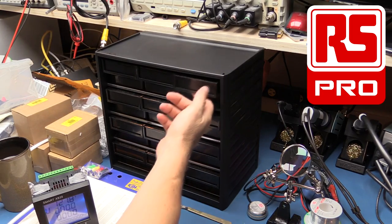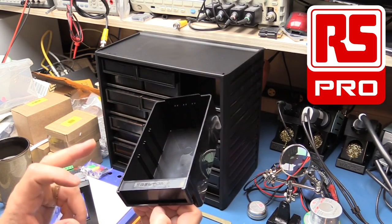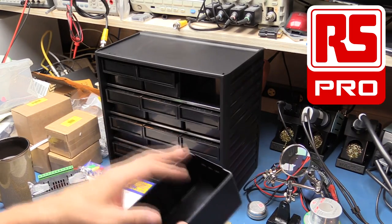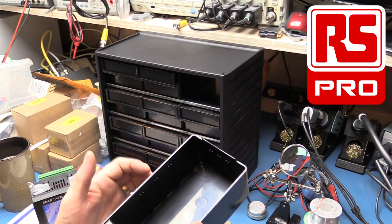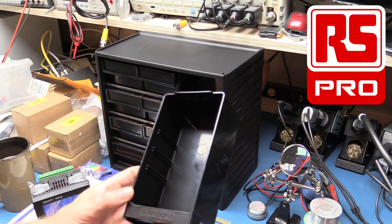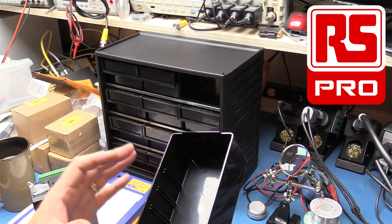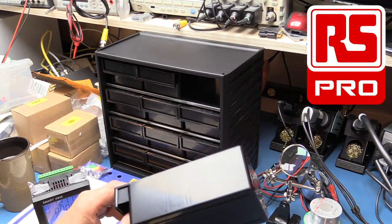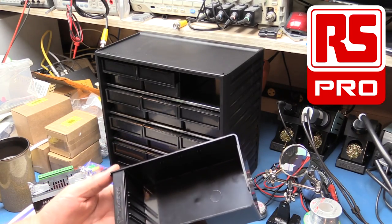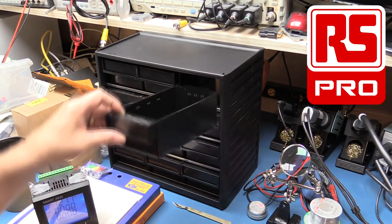The last thing here is the ESD rack cabinet. The key difference is that this is ESD, not just anti-static. So if I have components in here and I've got static on me and go to pick something up, this will not allow the static discharge to go through it. I don't have a high voltage generator, but maybe one day we'll set up an experiment to show the difference between anti-static and ESD protection. Dave Jones on the EEV blog has done some really cool demonstrations — you can check out his site if you don't want to wait.